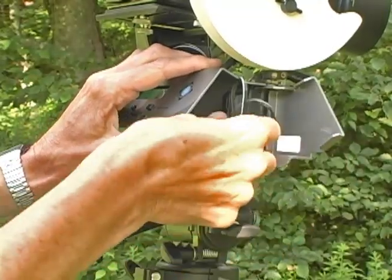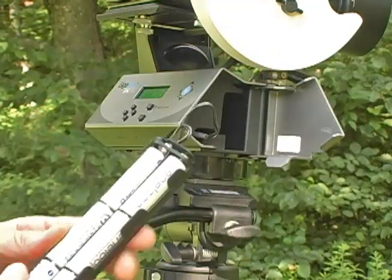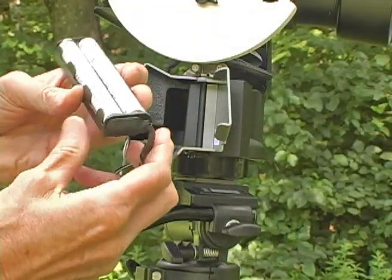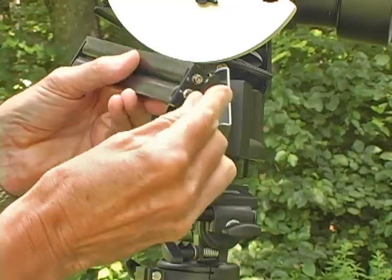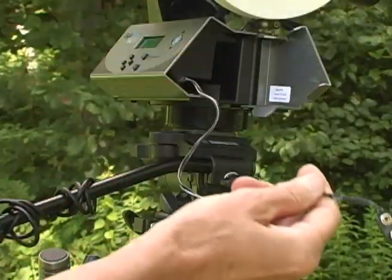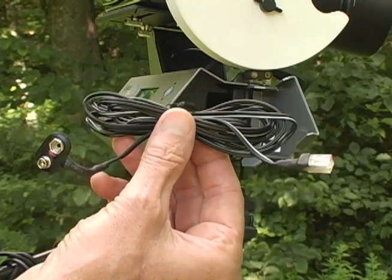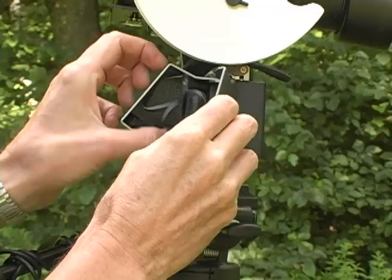The last modification was shared online by Mosley Hardy, who was disappointed with the short cable on the battery holder, which necessitates unplugging that nasty connector to change the batteries. These holders can be purchased for $2, and unlike the GigaPan OEM version, they come with a 9-volt battery connector. So you never have to unplug the nasty connector, and you can make a longer cable if you want, and you can have multiple holders ready to be switched in and out easily. I also made a 6-foot long cable so I could keep the battery holder warm in a pocket or ready to exchange in the middle of a panorama.